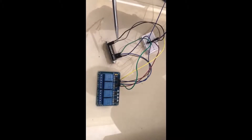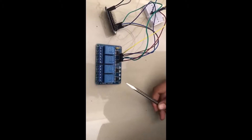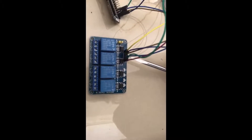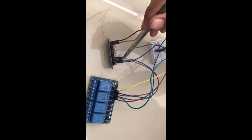In the first part, for the IoT based automation, D1, D2 and D3 pins of NodeMCU are given to this relay module. We are using a four channel relay module here. The fourth extra pin of this module is given to D4 of NodeMCU. Using this pin we are controlling all three devices at once.